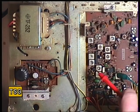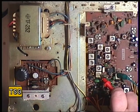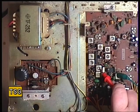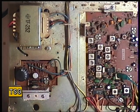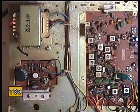If I did need to adjust it, it's L19 for the transmit VCO. I've checked the receive VCO, and again if we needed to adjust it, it's L18 — if I can read the photocopy. Once again that's still sealed. This set doesn't look to have been messed about with, and that certainly makes a change after yesterday's awful power of modifications.